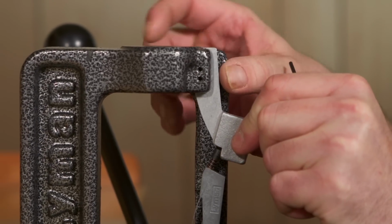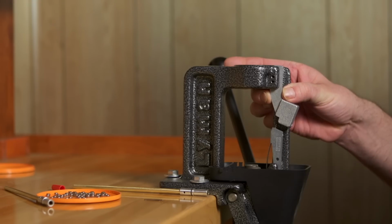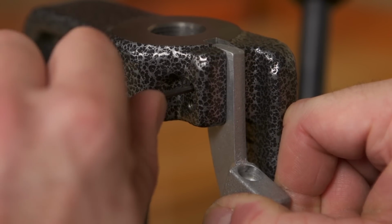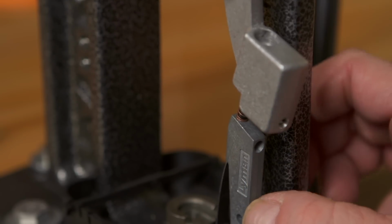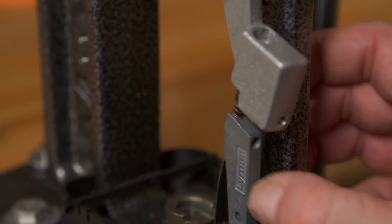Place the primer feed body between the lugs of the press body on the crusher press or the lugs of the turret on the T-mag press, and tighten the lock screws. The angle of the primer feed must be adjusted up or down until the primer tube is directly over the priming punch sleeve, when the priming arm is in the back position.